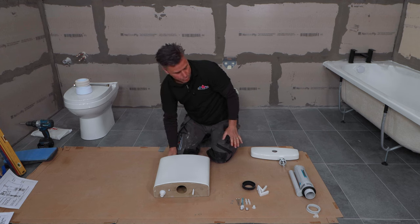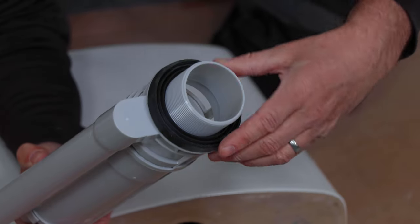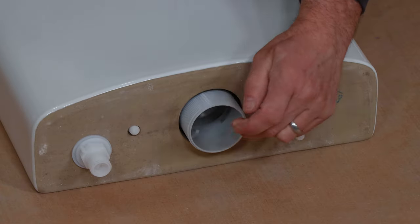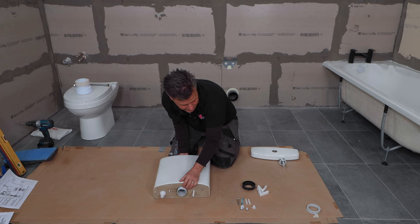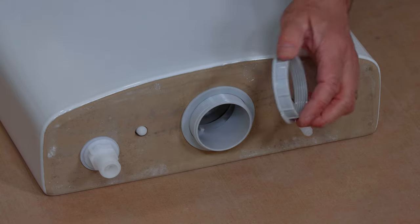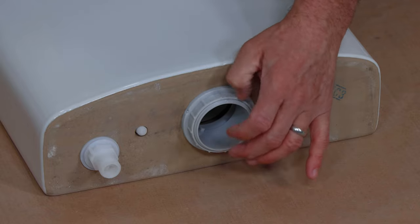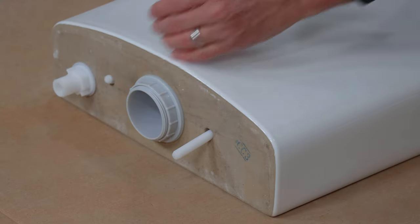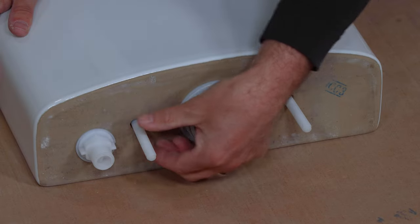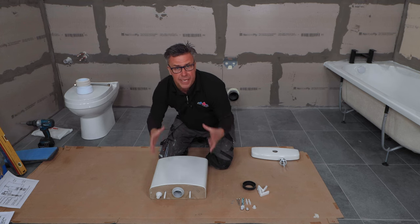For the moment we might need a little bit of movement while we put the next valve in. The next one is the flush valve, which also has a rubber washer at the bottom. So we slide that in the centre. The rubber washer around there — you can feel it kind of bung into the position where it needs to be. Plastic washer on there and the large nut lines up with the thread and is hand tightened. The tighter we do these, it's pulling it tighter into the base of the system. Once you've got it tight, just make sure that your bolts are coming out the bottom — you don't want to push them back in.